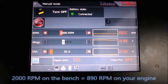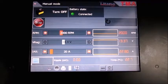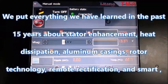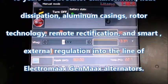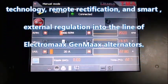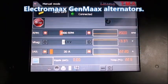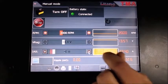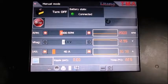The combination of these two technologically advanced products charges batteries much faster and increases the longevity of your battery bank. Right now, our Emax regulator remains in its initial soft start state, before slowly ramping up to the set amperage. Here, the engine has a chance to get up to speed and warm up before there is a full charge acceptance by your battery bank.